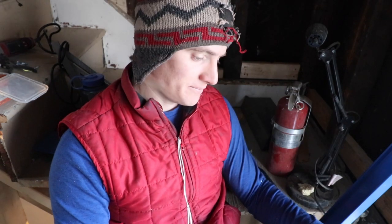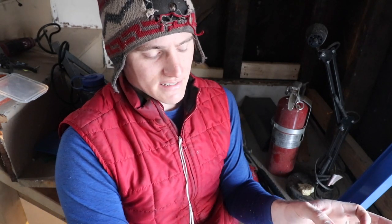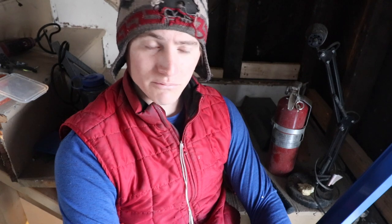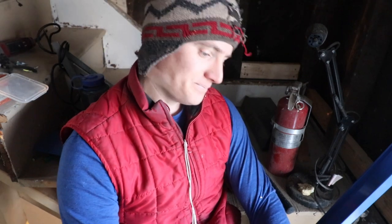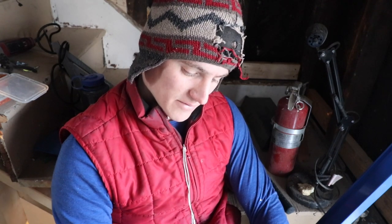Like most people, you buy this door, it's got brick molding, you remove the old door, and then you just push it against the siding and then shim it and screw it off, and then you're done. But something like this, I'm removing the brick molding, making my own trim, and fitting it in, making decisions. The wall it's mounted into isn't completely plumb, so deciding, do I want to put the door out of the plane of the wall, but make the door swing correctly? So it's a lot of stuff like that, that if you paid somebody to do this from the street, it would look fine, but then when you got to fooling with it, the door wouldn't shut quite right. I get a lot of people telling me to hire people to do this and that, but it is very difficult.